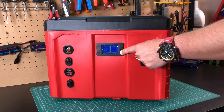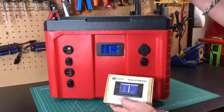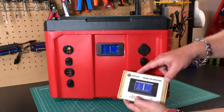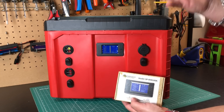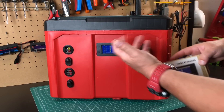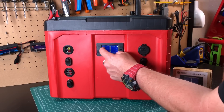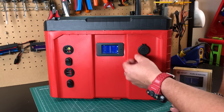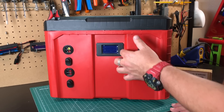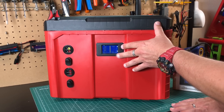This meter here is really awesome. I've been using these for quite a few years now — I have these in all of my battery boxes. I get these on Amazon, they're 18 to 20 bucks. I get two different brands; this one's from Spartan Power. It's got a 100 amp current limit with a shunt that comes with all the wires you need. They're really accurate — they show you your voltage, current used, current that you're currently drawing, time, and capacity. I took this out for a POTA activation and used 5.62 amp hours. It has memory so you can turn it on and off, and you can set the voltage and clear memories — all done through this button. Really easy to wire up.